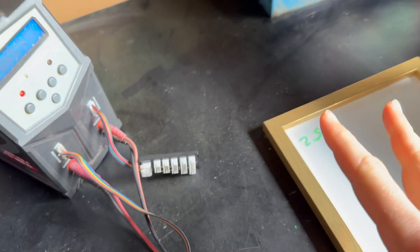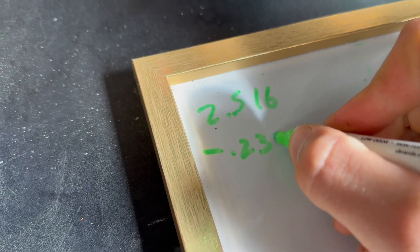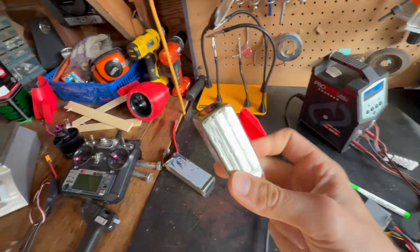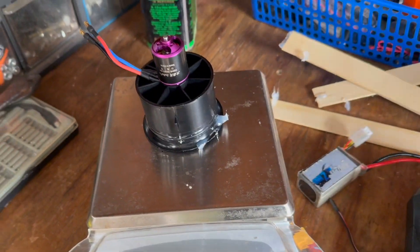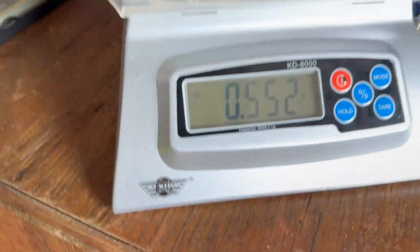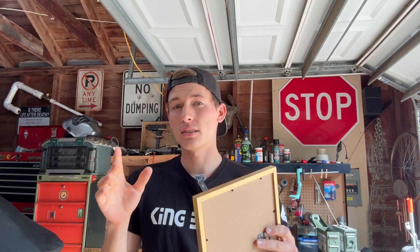So it showed 2.5 pounds of force. Now I'm going to grab the speed controller and get its weight: 0.230. As for the battery, I'm going to Google a smaller one — it'd give us about a minute and a half to two minutes of run time. Using this large battery is not practical since it weighs about two pounds itself. After accounting for the fan, a small battery found online, and a mounting piece, each EDF fan has a maximum thrust of about 2.5 pounds. After subtracting the speed controller, battery, and fan weight including a bit of plastic for mounting, it can lift its own weight plus about 1.33 pounds.